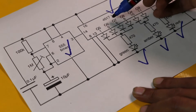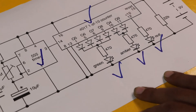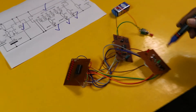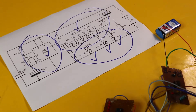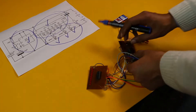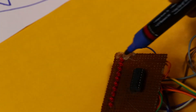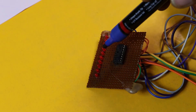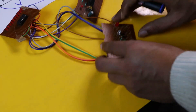The pulse from the 555 timer is fed to the 4017 counter IC which then drives the traffic lights. We are running it at 9 volt battery; you can also use a 12 volt battery or adapter. The circuit has three sections: the 555 timer, the 4017 counter IC, and the green, yellow, and red LED section. We have also used small LEDs on the 4017 counter IC to check whether all pins are working properly.